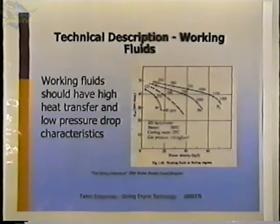If you look here at, let's say, 35, an engine that's running at 35% efficiency, and compare the different gases, you'll see that the air engine here is producing, down at this axis, we have power density, or horsepower per liter. You can see that the horsepower per liter here is on the order of 5. I guess that's 10. I'm having trouble reading that from here. Yeah, this is 20, so that's 10. If you look at the helium, we're up here. This is about 45 or 50 horsepower per liter, and the hydrogen is way over 60. And that's quite a difference if you look at the performance in these different gases.